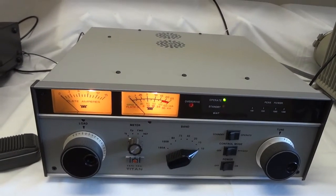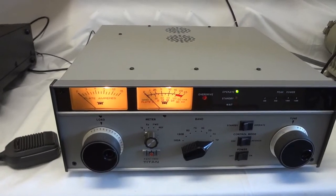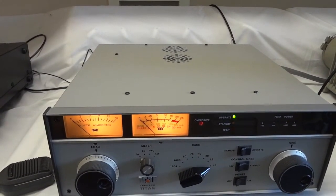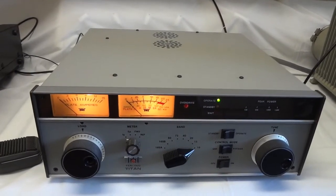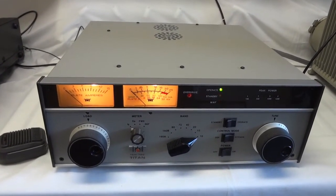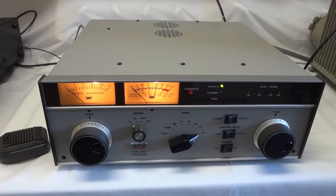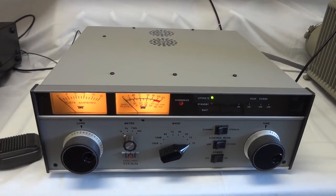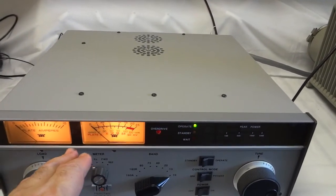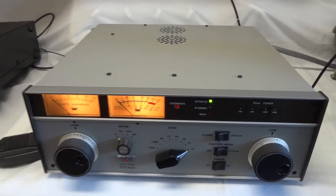I don't know if you've seen test reports, but this unit is actually one of the best amplifiers ever made when it comes to intermodulation — or the lack thereof. It has second-order IMD at 45 dB below PEP, which is better than anything on the market today with Chinese and Russian tubes. I say stay away from those — go for real Eimac and get yourself a real amplifier. Built in the late 80s and it can still compete with anything on the market today, as long as you know what you're doing. Keep that grid current in check, not above 60 mA, and this thing will last you a lifetime. Thank you for watching.